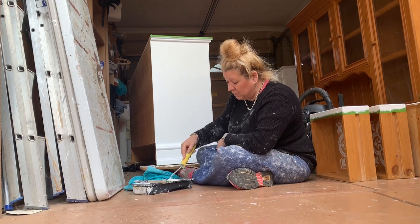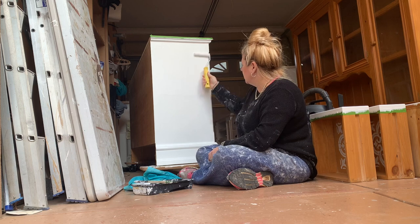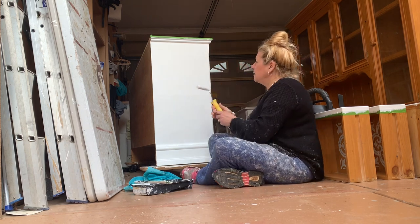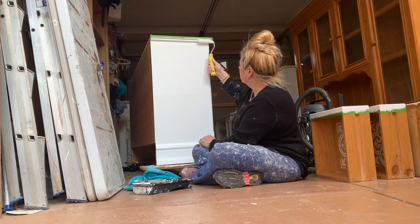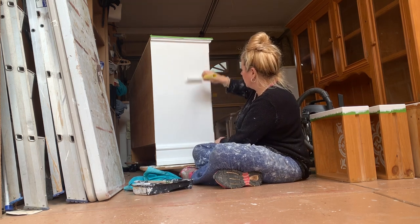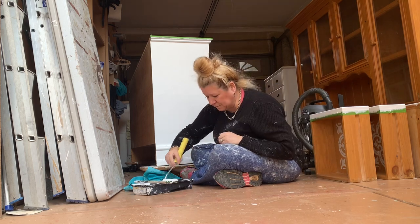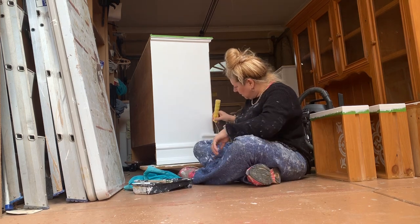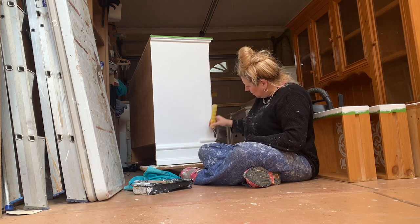I'm a little bit messy but also a bit of a perfectionist. I take the roller and just roll it to get most of the paint off the roller first. The reason I do that is to avoid getting too much paint at the top, because that's definitely where you get most of your runs. Then I come back over to get rid of any brush marks on the side. I give it a check — yes, that's looking good. We get a little speck coming in from the wind, just take it off. Then roll it down, get the bottom, roll up on the moulding and up and down.